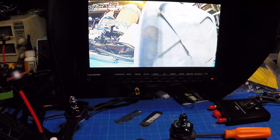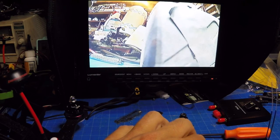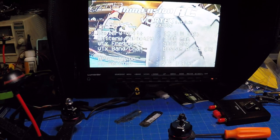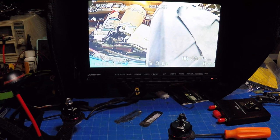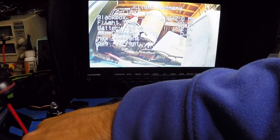I had to reconfirm my switches again, and basically we're arming right now. I want my failsafe to do absolutely nothing, so I'm going to switch everything to off and just press the failsafe button — and it's going to blink. Now I'm going to reset the quad. Telemetry lost, telemetry recovered. Turn everything on, arm the quad, and turn the power off to the radio — and the motors should stop. And they did. Failsafe is all taken care of.